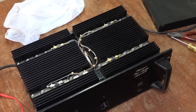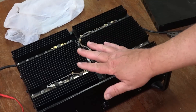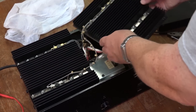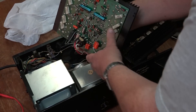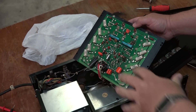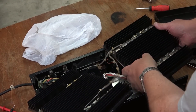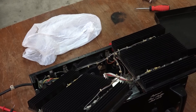Looking at the top of this unit, you'll see that there are 12 output transistors per channel. It's a dual mono design. I've already removed the screws from the heat sinks here so we can lift the boards out and swing them out of the way. Here's our amplifier, here's all our driver transistors, and our emitter follower resistors for the outputs. Here's the fan I need to get at back here — it's just held in place by a couple of screws. It should just be a matter of unscrewing one and screwing the other one in.